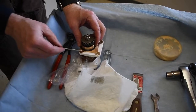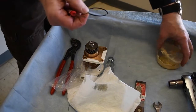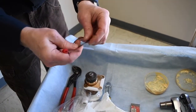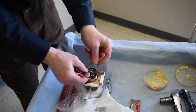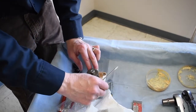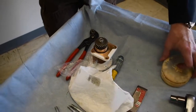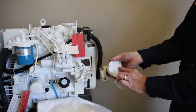Replace the O-ring on the pump housing. Use a small amount of silicone dielectric lube to protect it during dry startup. Reinstall the pump with the seawater hose fittings closest to the belt guard.